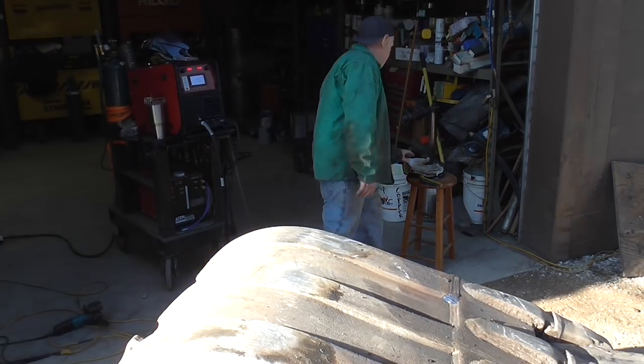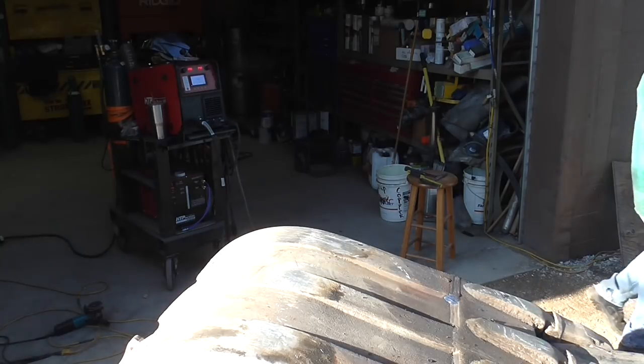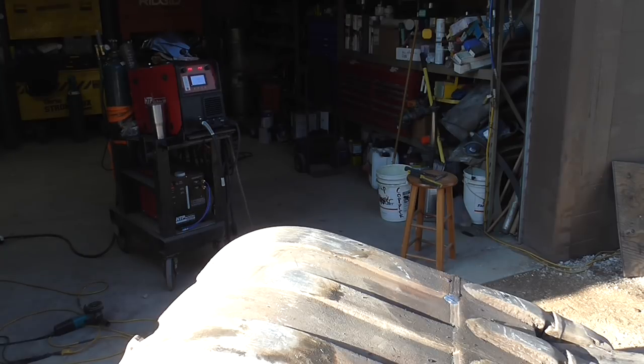See, this goes to show you it's not just a couple guys standing around there. Actually, sometimes you do find some more cracks or hairline cracks that open up with the heat from the welding. So then you can see those and you can address those.